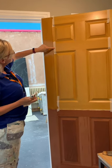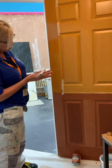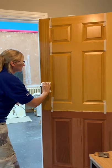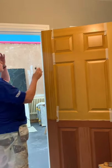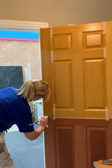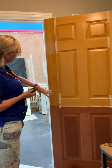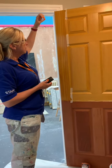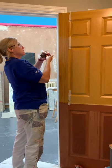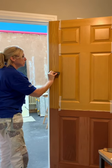This is how we're going to do the stile. I've taped up the rails this time. I've applied the scumble and brushed it down. Just going down with the rag and comb all the way to the bottom. These don't have to be dead straight, but they don't want to be too wobbly that they look false — a little bit of movement is okay. Now I'm going to show you a different way to get a really long open grain. Oak is a tight grain, but if you get a knot in it, it's a very long open knot. What I've got here is a rocker.